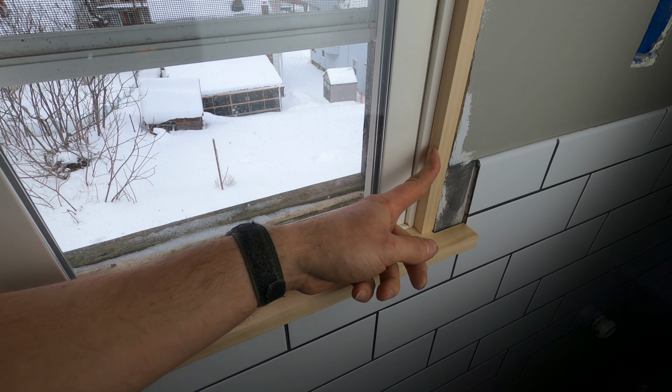I keep the board tight to the saw's fence as I slowly push the board through, keeping my fingers far away from the blade. Then I sand off any saw marks from the back of the board. Now that the board is half as thick, nailing it to the sill will be really difficult. I carefully aim the nail gun as straight as I can so the nails go through the sill without missing the apron. After everything is finished, I give the frame a final sand before I give it a coat of wood stain.